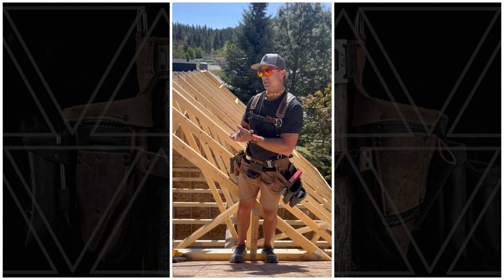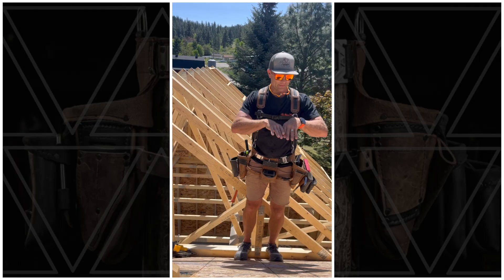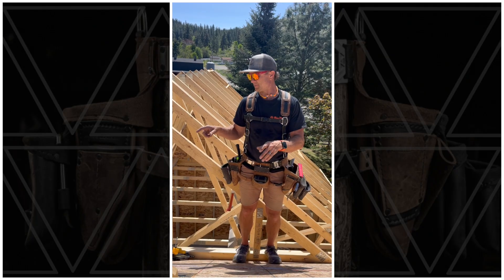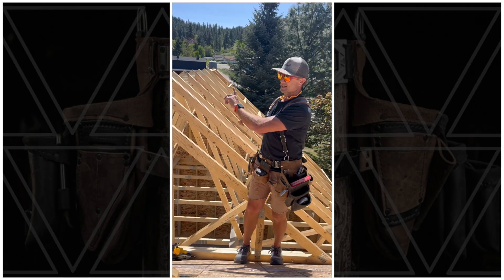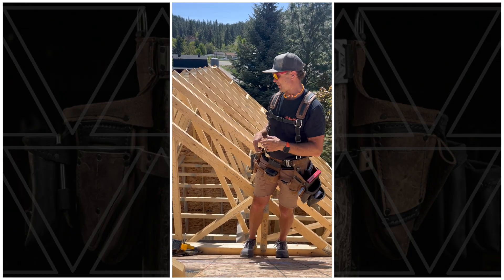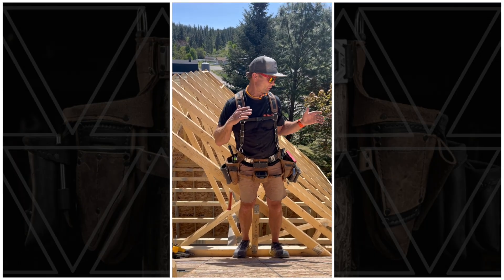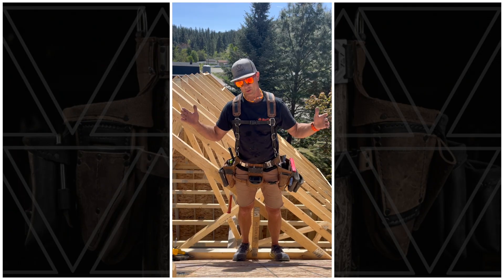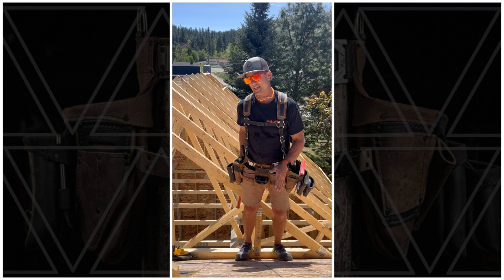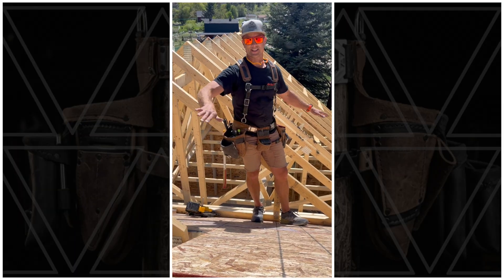To get these two sides taken care of, we have regular trusses on either end, a whole section of scissor trusses through the center, and girders on both ends. I sheeted on top of that and now we've set all of our valley trusses in between on top on layout. Because everything is square and our sheets are perfectly on layout, I pulled the trusses to layout and snapping the valley lines was straightforward.